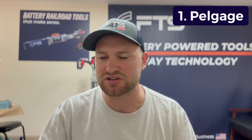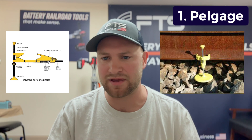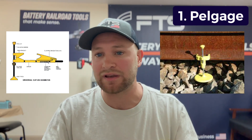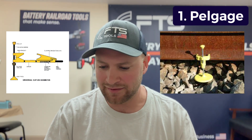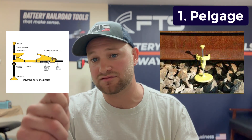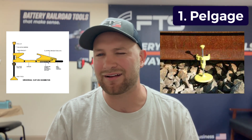Now that we took a look at how Dynamic Void works, I wanted to look at a few other ways you can manually measure vertical deflection or void under full dynamic load. The first one is called a Pell gauge void meter — it's a greenish-yellowish device. It clamps to the base of the track, so you actually have to dig out the ballast. That's one of the biggest challenges — it's time consuming to dig out that ballast to hook this device up. As the train passes over, it moves that sliding collar down and you're able to measure how much void occurs there.